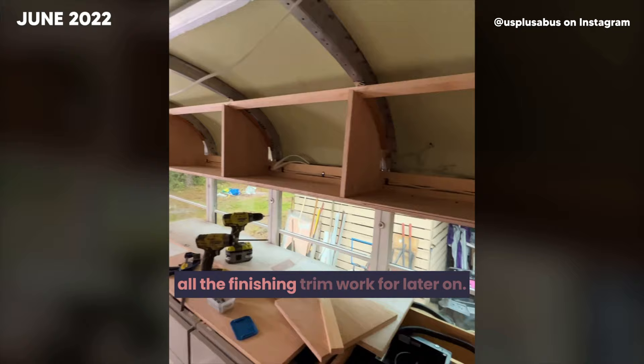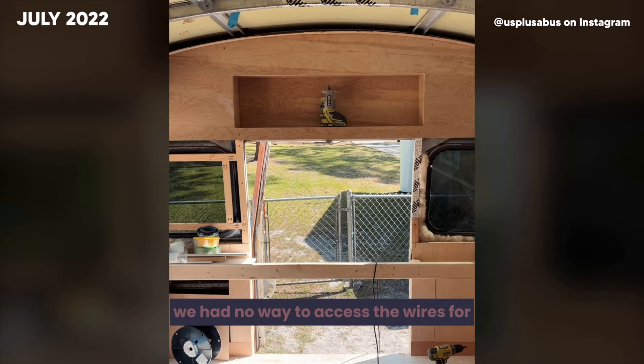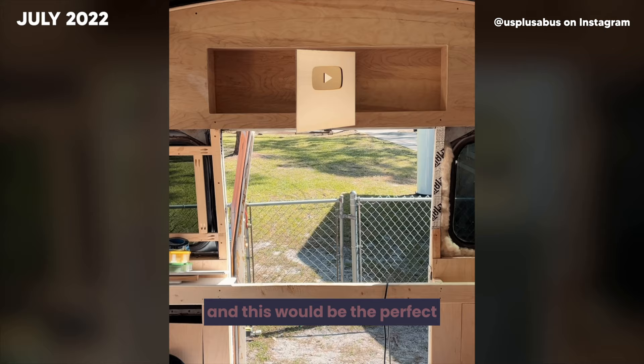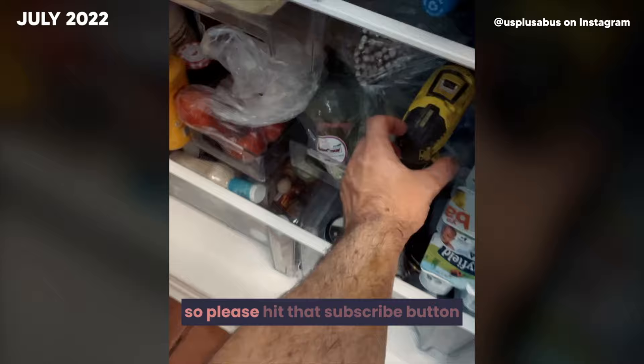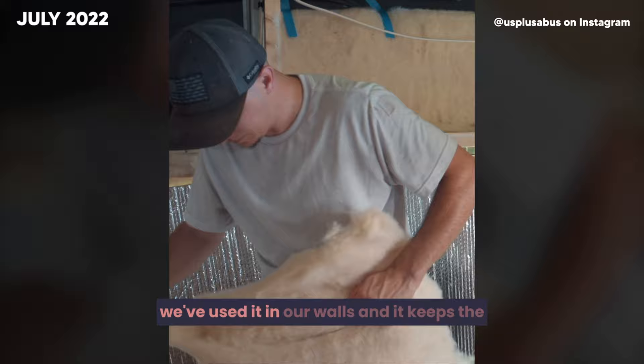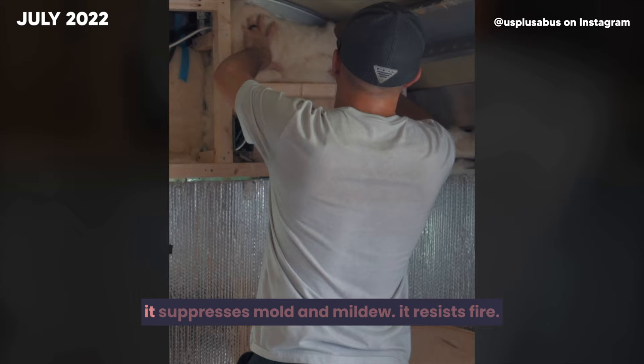The upper cubby was perfect except it had one major flaw — we had no way to access the wires for our backup cam once it was in place. Since the upper cabinets are screwed into it for support, it's not coming back down. We're less than 600K away from 1 million subscribers, so please hit that subscribe button. After taking it back down, we cut a hole that we'll cover with a door or decor to hide it. Right now we're going to insulate behind it using wool — from a sheep. We've used it in our walls and it keeps the bus much cooler or warmer. It's natural, it suppresses mold and mildew, it resists fire, and it's non-toxic.